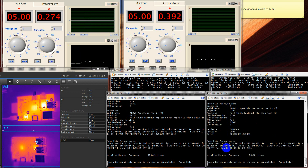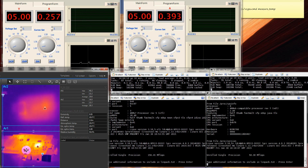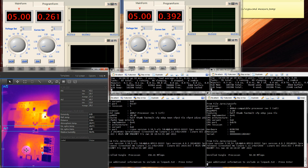These tests are also done. Please take a good look at the thermal imaging camera — you can see that the old Raspberry Pi is now 50 degrees Celsius and the maximum temperature of the new Raspberry Pi is 42 degrees. I will flip over the new Raspberry Pi since the memory controller is on the bottom — so here you have the temperature of the other side. I will also show the temperature from the old one on the other side — by the way it leaves a heat footprint on the table. On the bottom you can see the ethernet controller is quite hot, and the white spot is the hottest place on the PCB.